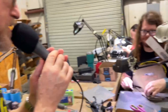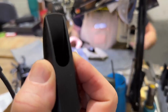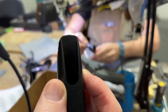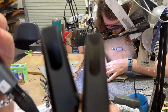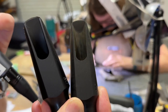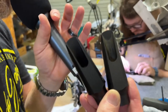Over here is the handwork, and these guys are experts. Sebastian is working on the Jody Jazz HR Star — probably our most popular mouthpiece. This is unfinished — that mouthpiece would kind of play, but when Sebastian finishes, this is what it's going to look like. He has made that baffle work into the tip rail by taking material away, and he can do this better than the machine can. The mouthpiece truly sings at this point. The tip rail is about 25 thousandths of an inch thick and perfectly symmetrical — very hard to do.